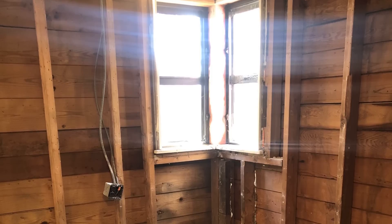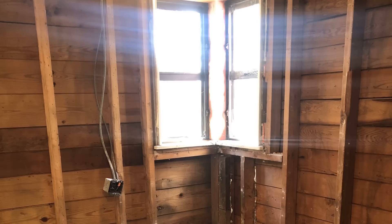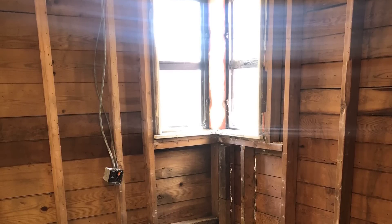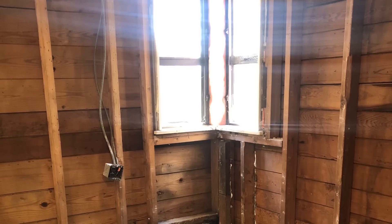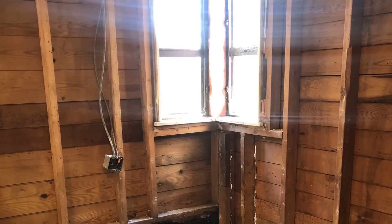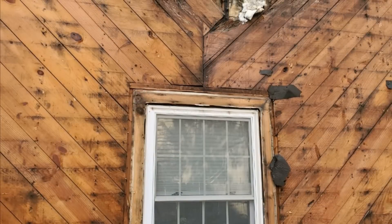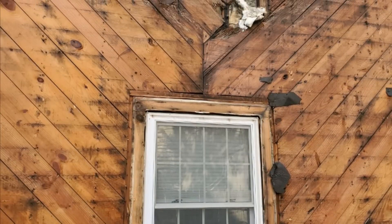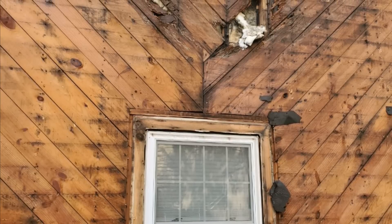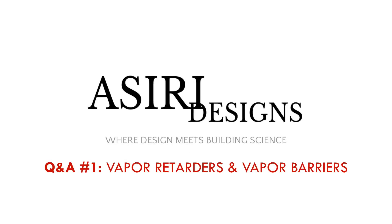There is a way to retrofit insulation into a cavity space interstitially between the studs, but when you get into much colder climates like Illinois with extremely cold winters, your condensation risk is much, much higher, and the risk for deterioration is also much higher. So be very careful when insulating really old farmhouses and buildings. That's all we have for today. If you like this more laid-back Q&A format, let me know in the comments below, and if you haven't already, leave a like and subscribe for more weekly building science videos.